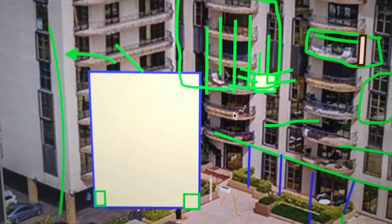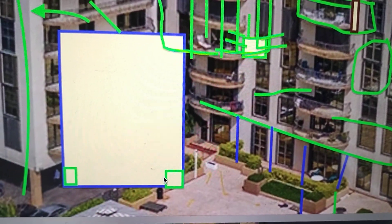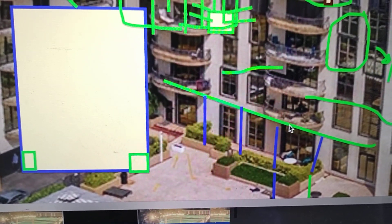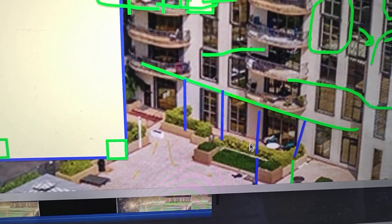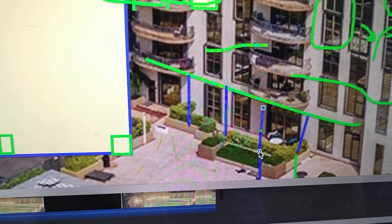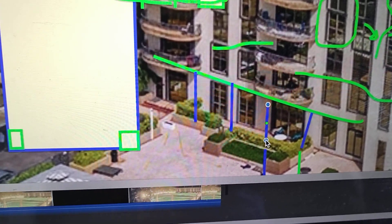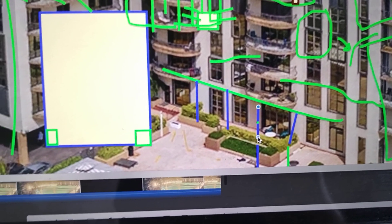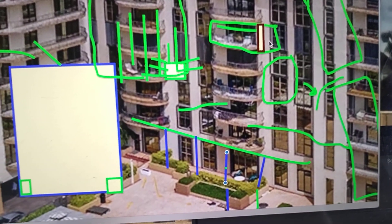In the longer video I talk about the sixth floor where the lady was — was it this wall she was looking at? It would be a column she separated by two inches. Is this the column or is that the column for the other side? If she comes in here, that's the hallway she had time to skedaddle. I talk about how you get an unsupported span at that point — the loads are going from here to here. Once the deck starts pulling on the column, it weakens its capacity, throws it slightly out of plumb. It's still holding up for seven minutes — slightly out of plumb it's no good, but the floor did its own damage, caused its own drama and trauma to the column connections. Pulling them, rattling the building — two inches up there is a hell of a rattle.